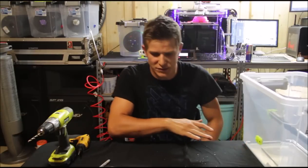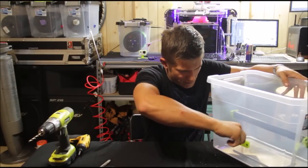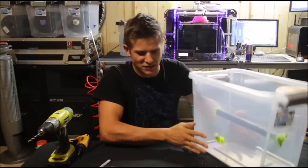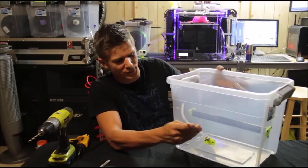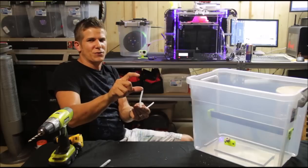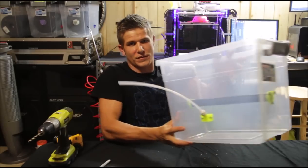At this point we're pretty much ready with the box. There are a few other minor things you can do — you can use a quick connect adapter if you'd like; you don't have to use a hose. What I do is use a quick connect adapter and mount it to the outside angled feeder bracket. It's supposed to be threaded — and there it goes, it actually threads on. 3D printers are amazing — you can print threaded objects and everything just works. So you have your quick connect adapter and your tubing. I use a short piece of tube that goes mostly to the feeder, so maybe only an inch or two of filament is exposed to air before it enters the system.